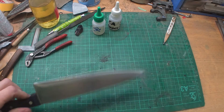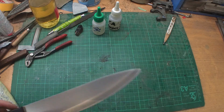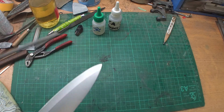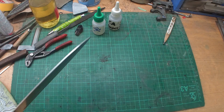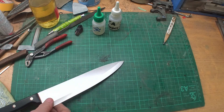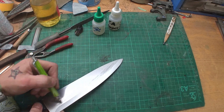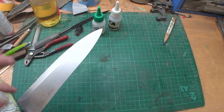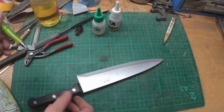Today we're going to make a kitchen knife out of a kitchen knife — we're gonna restore an old piece which has pretty tough steel. The file skates off it, which is nice, so it's hardened very well. It's pretty sturdy, pretty springy, and the blade is not too thick. We're gonna completely round out the blade and take away material on both sides so we get a nice taper from top to bottom all over the whole knife, with no edge feelable anymore.